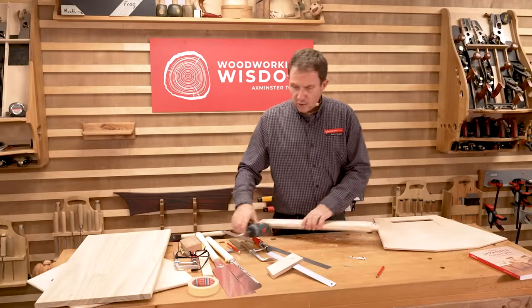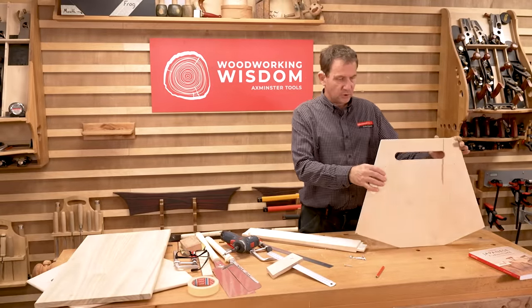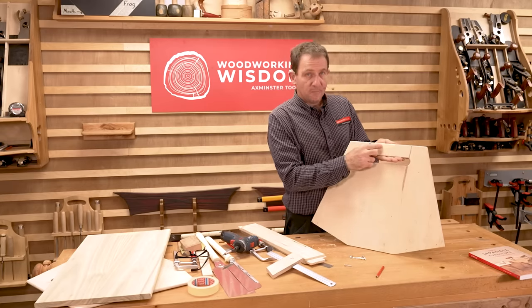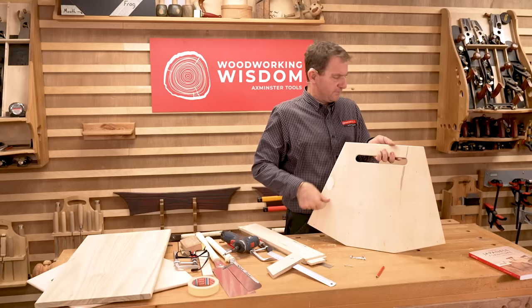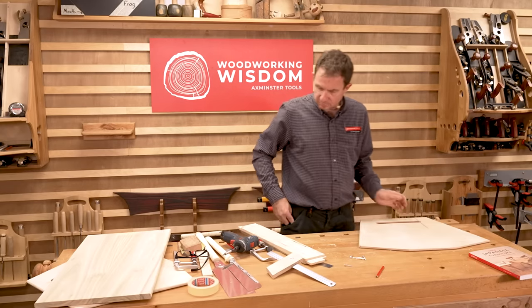So starting now to try and put things together, we've got the top, or the shelf as you want to call it, we've got the plywood sides. So on the plywood, I want to find the centre point. So I put a little bit of masking tape, draw a centre line. That weird things, isn't it? Okay, why do that? That saves me drawing on what we've cleaned up.